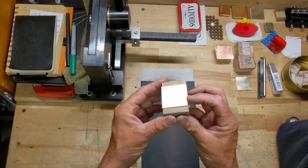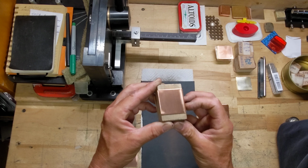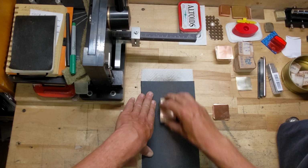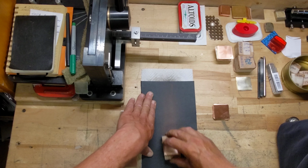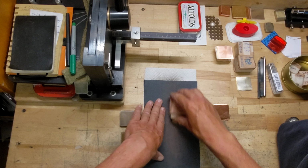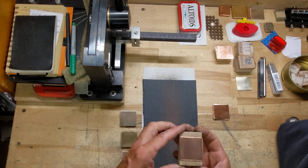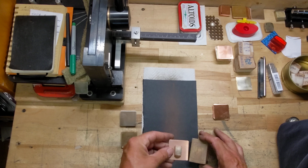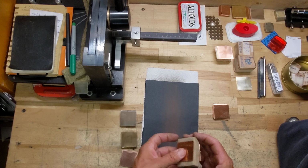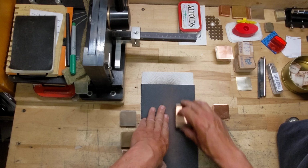If we have these kind of halo areas that don't get sanded, that tells us it's not exactly flat, so we'll sand those till it's very minimal. This particular billet I'm going to fire in a gas forge and use the hydraulic press to help flatten all the metal. Flipped it over, and then sand the reverse side.